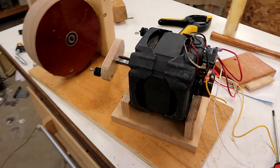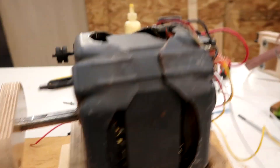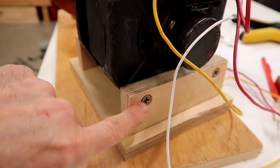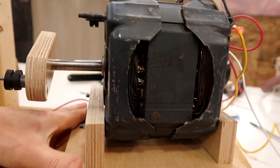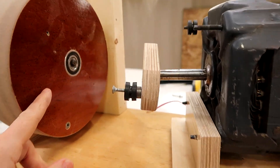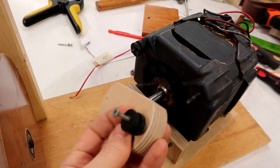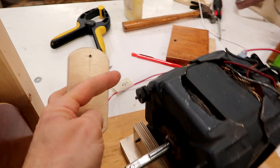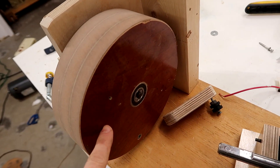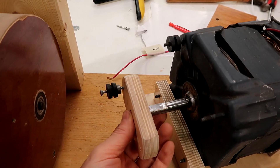I got a mount made for the motor on the front — I just used the studs that stick out of the motor in the corners. On the back there are some holes in the corners; I just threaded those and screwed some machine screws into them. That sits on the base and will slide in some rails back and forth to disengage it from the wheel. To couple to the wheel I've got this yoke, and in the ends of it there are going to be rubber bushings — which are actually what the motor was originally mounted on — and those will engage some slots in the wheel.